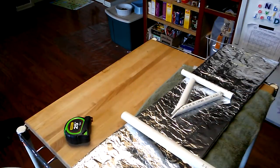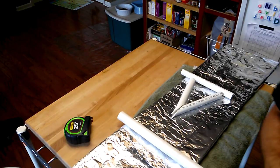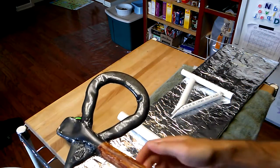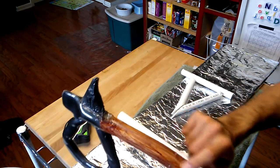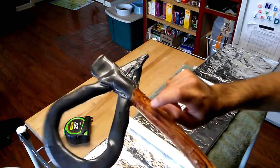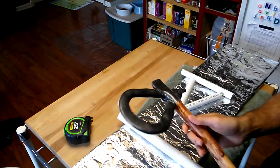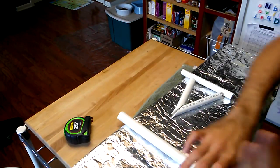This is going to be sanded down and turned into a nice wood grain texture. Here's something you can tell — I over-applied and was trying to make it very dark. This is what happens when you over-apply shoe polish on PVC that's been inadequately sanded. Down here is where it's been perfectly sanded. Just depending on where I was when sanding: good, bad, good. This was a very early work in a lot of ways, so it's not very impressive — the idea was good, but the execution was not.